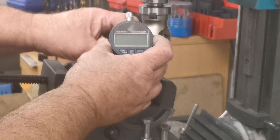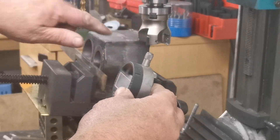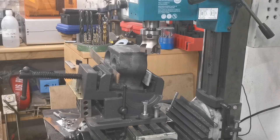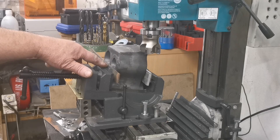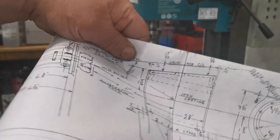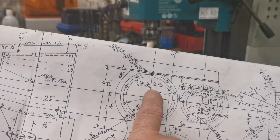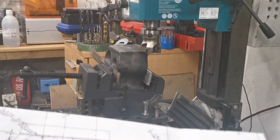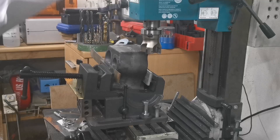To get that level, I've used a gauge and gone back and forth many times to get it as level as I can. I've chosen the best corner and done the same again. The center from the cylinder to the top corner is 1 and 3/16 inches. You'll see when I machine it that it's going to cut into that flange there. If I show you the drawing, it's 1 and 3/16 from the center of the cylinder to the top, and it's going down on that flange — which is exactly what's going to happen. So don't worry if you think it's wrong, I'm going with the drawing. Let's get on and machine it then.